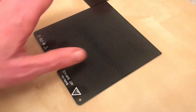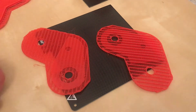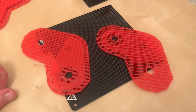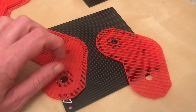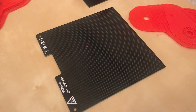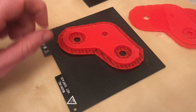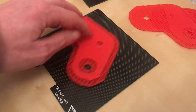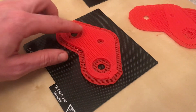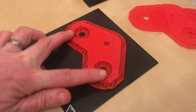I printed on this and I think I actually had two semi-completed prints on this material. What I ended up doing was recalibrating the nozzle height, getting it really close and setting it down a little, and I got this far — basically tried to get that first layer to squidge down really close. That actually worked until the edges lifted up, confirming the fact that the longer the part the more likely it is to come away.